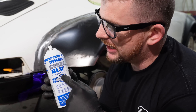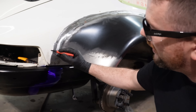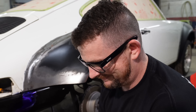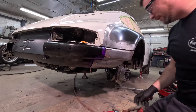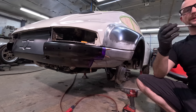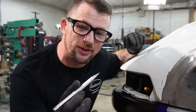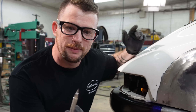If you're new here and don't know what I'm doing: I'm using Dykem Steel Blue - I prefer the aerosol can version - and I'm going to use that to scribe my line so I can actually see precisely what I need to cut. If I use a marker, it's going to leave a very thick line, whereas a scribe line is going to be as thin as the tip of a needle. I'd rather have that instead of this much tolerance because I want to have the tightest butt weld possible.